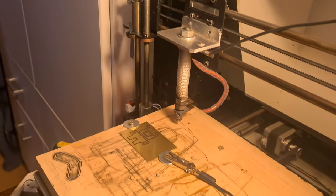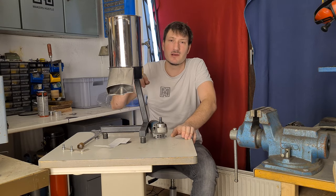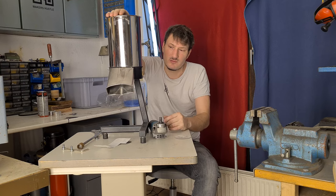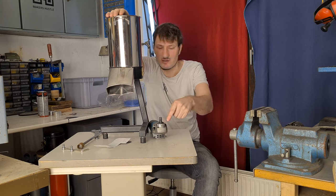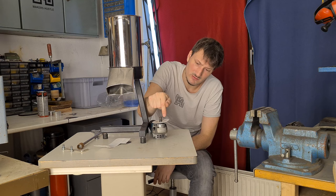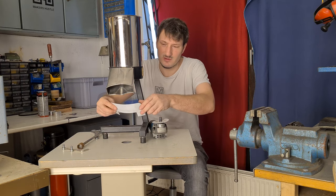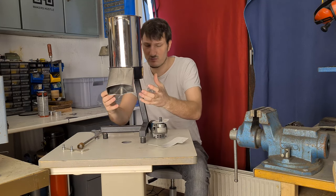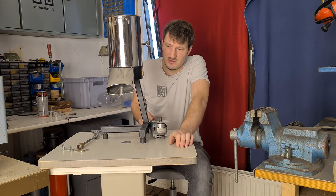If you want to shred wet material like apples, sometimes a little drop of water comes through the system through the bearing — it's just a bearing and nothing else. To get rid of this drop and keep it from getting into your grinder, I designed a little flying disc: if a drop comes down on it, it gets thrown away pretty fast. If you don't want water all over the place, you may also want a splash guard around the whole construction — plan it from the beginning.